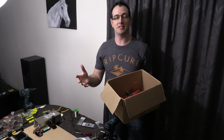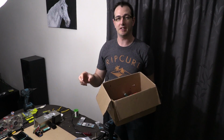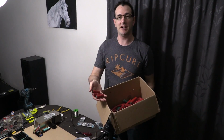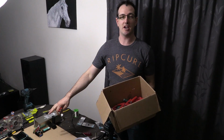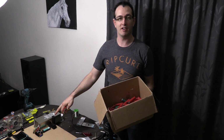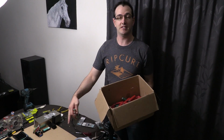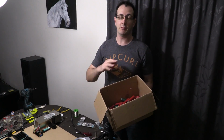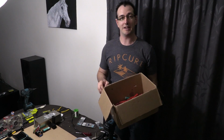So tubers, now that that's pretty much finished, first thing we've got to do before we put it back in the garage is do a load test. And what better way to do a load test than a whole pile of red Sanyo 18650 cells. So we're going to fill the charger up with 18650s. We're going to look at the watt meter, see how much power it's drawing, and we'll also use our temperature thing and figure out if there are any hot spots, and if things are going to get too hot. If everything's good, then we're good to put it in the garage and the project's all done. So let's first plug in all the cells.